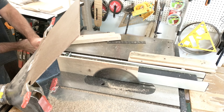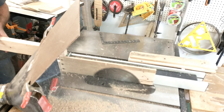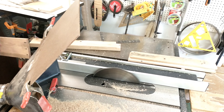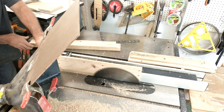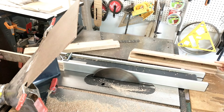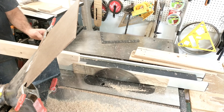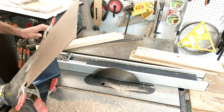This one piece is taller than the blade, so we're going to have to do a second pass through to get that upper portion off. Chris's push stick is a two-by-four that he's using, and it's extra long because this is extremely dangerous. That saw blade is up way higher than it should be and has no guard on it, so make sure you are not wearing any loose clothing, your hair is tied back if it's long, and you have safety glasses on.